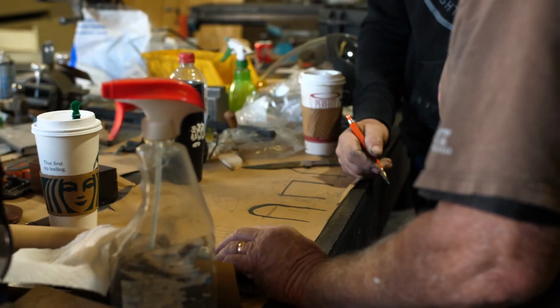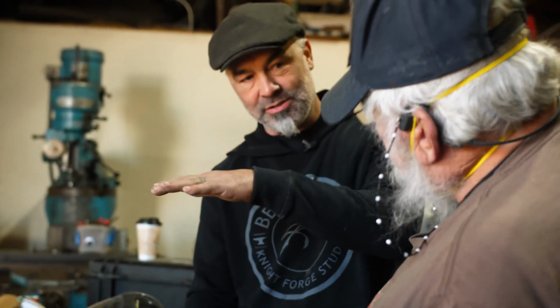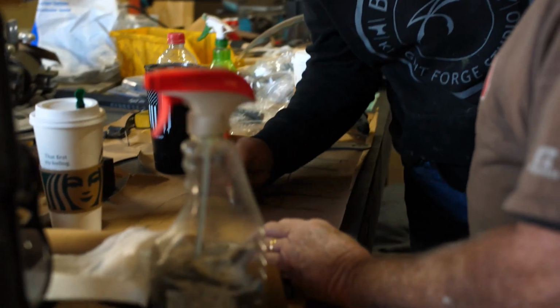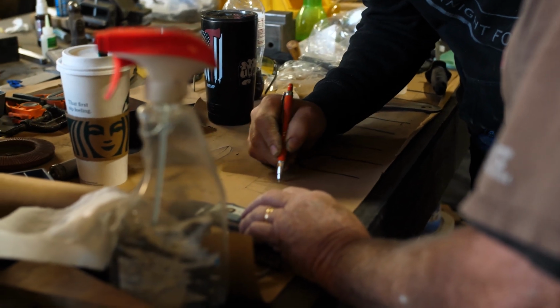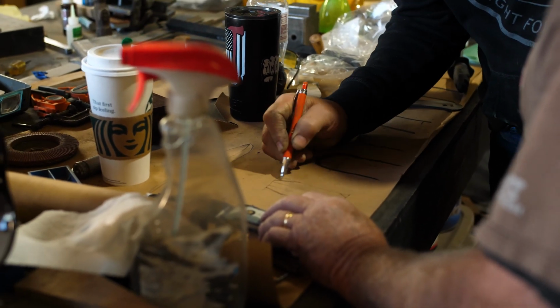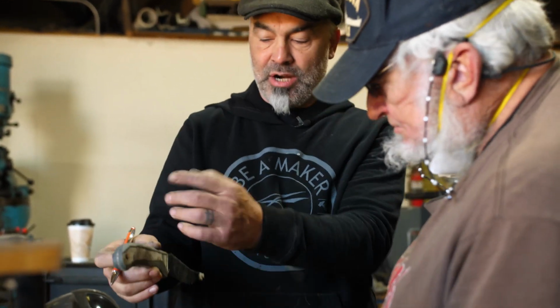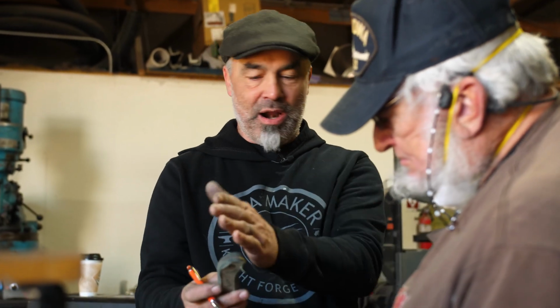Watch it cut. They're used to seeing things in planes. So we're roughing it in by making these planes. And however you do them, it don't really matter. I showed you how to do it on the wheel. I showed you how to do it flat. Both of those are complicated because this is all curved and that cross section is rectangular. Anywhere we cut it, it's a rectangle. But now it's starting to get egg shaped.